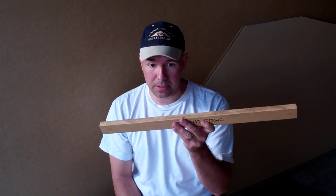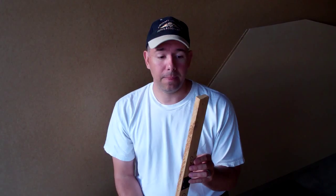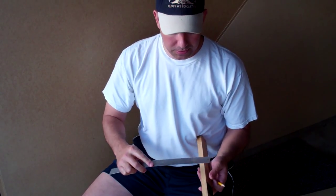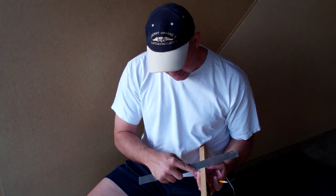What I've found is a lot easier: I've got a piece of oak strip from Home Depot that's ¾ inch wide. I use this for a smaller fence clamp for straight edge cuts with my skill saw, but it also makes a good marking guide. You want a really nice, straight, clean piece of wood — you can use poplar or maple — but I use oak because it's a good hardwood, it'll last a long time, and makes a good marking edge. I've taken my metal ruler, which I've also suggested buying from an art supply store, and confirmed it is indeed ¾ inch wide.